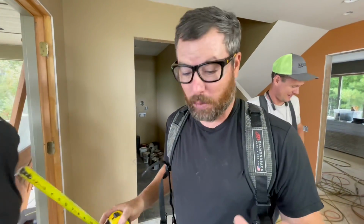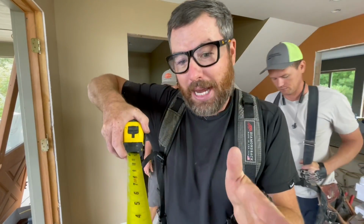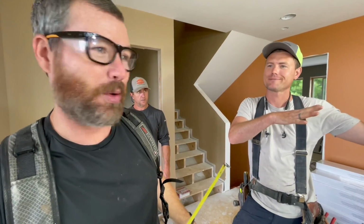Nobody. We're going to chalk a line to start with, and that's really important that the chalk line and the flooring is actually running parallel to the walls in your house. So when we start here and get to the other side, it's not this big angled rip against that wall, right? Unless you're going for that angular look. No, we're not. We're going for a good looking floor.